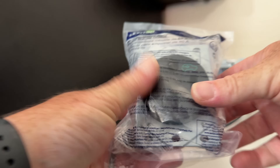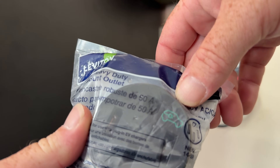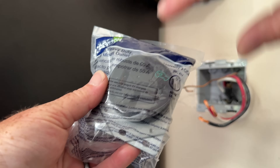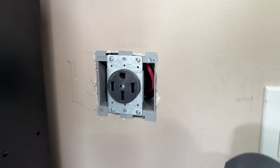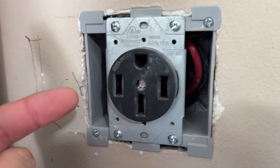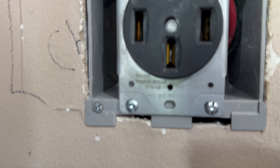That is just another new option on the market. I've really liked that they're starting to put the EV designation onto these outlets — I think that's where the whole industry is going, and that's going to really help with safety. Please, I implore you based on my own failure and experience: check out the outlet you have in your garage. If you're using a 14-50, this is one of the options you should consider to replace it with. As you saw, it is literally a couple of bolts — you need to get a torque bit, which I've got linked in the description. Swap it over. Don't ever worry about shorting out because the prongs are getting loose or the wiring in the back is loose or the material itself is overheating. They're not made for that. This one is. Please take a look at what you've got. Thanks so much for joining us today.